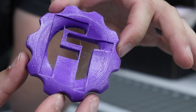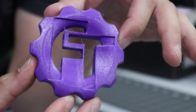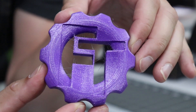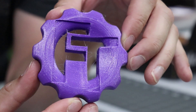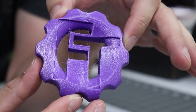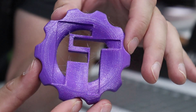This was printed at 235°C, 80°C on the bed, cooling fan at a max of 30%, and printed at 50 millimeters a second — that's pretty much my standard speed for PETG on any printer. It did fill in very well and work out nicely aside from the little printer issue. I've already reviewed a spool of this and it still printed out just as good.